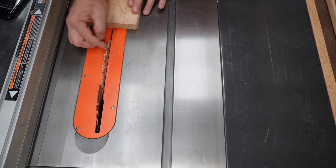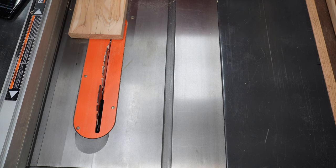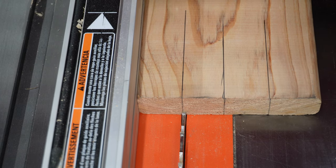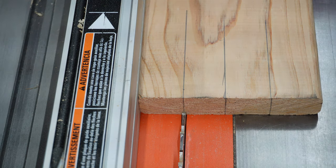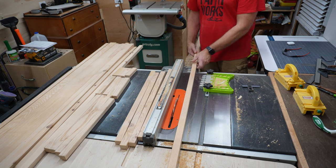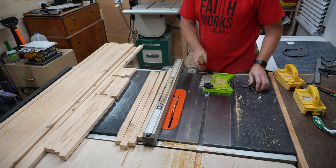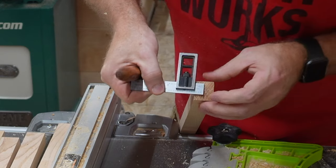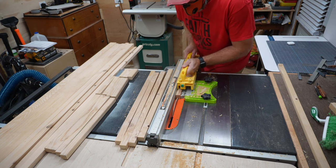But before you go cutting to the line, you also have to take into account that the blade is going to cut a kerf. So if you set your fence to cut to the line, your last strip wouldn't be as wide as the other three, because you'd be progressively losing that blade kerf with each cut. So you have to line up your line in the center of the blade and then set your fence. That gets me really close to 1 and 3/16 inches — so that's my slat width. Now I need to flip these 90 degrees and rip them in half. I find my center point on this edge and end up with just under a half an inch. That's close enough. So I end up with 8 strips instead of 5 if I were using 2x4s.